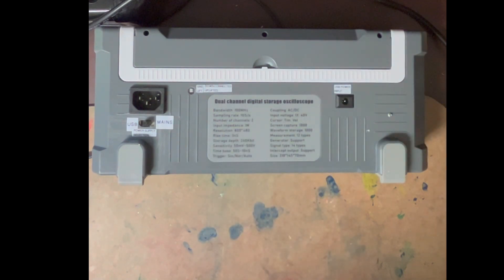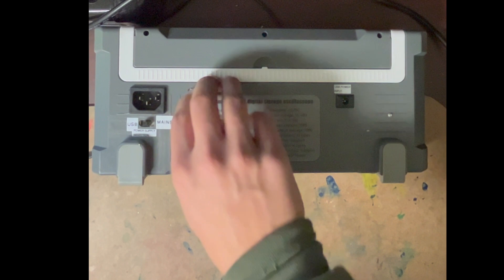Pretty much this whole back is hollow, which I thought was just stupid. So originally I had four 18650 cells in parallel and a little power bank circuit that was supposed to run it off a battery. The power bank circuit couldn't handle it — all this stuff is salvaged, none of it is new. This thing wants about 1.1 amps, and the power bank circuit could only handle about 750 milliamps, maybe an amp at max.